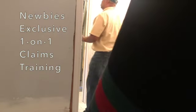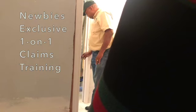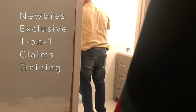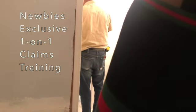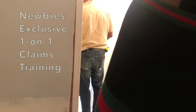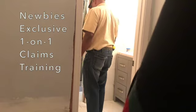All the doors were removed. These are new doors — new doors on frame. All the doors on frame were removed. We're saying that they're new — these are all new. The jambs are all new. They tore out all the doors on frame. He's still working on this — he's coming back to finish it today because all these are new. Look down at the bottom of the wall. Yes, I see two-by-four. Go all the way down — see if you see any water stains on that two-by-four. They're there. Is there any water stains at the bottom of the two-by-four? Yes. Great. So we got water stains going up that were never addressed.